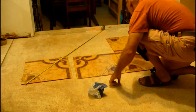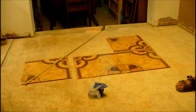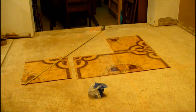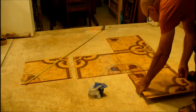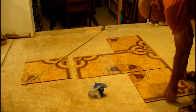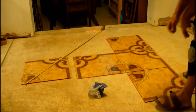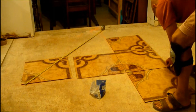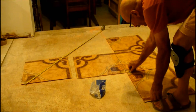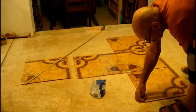I just moved this whole frame when I tried to adjust that one. You can guess at what you think a quarter inch is, but until you get these guys standing up inside, you won't know. I can probably tell I'm going to have more than a quarter inch over there. Let me get another one down here and get all this stuff off the tiles. I'm going to put one across here and get it about an eighth of an inch from the chalk line, then set these guys off here.